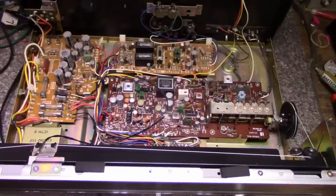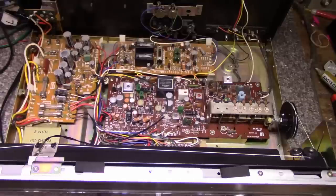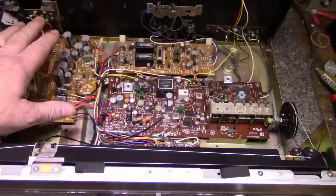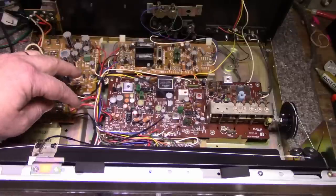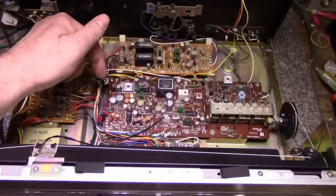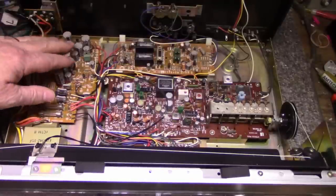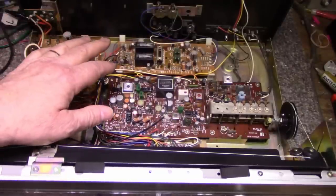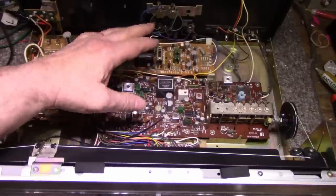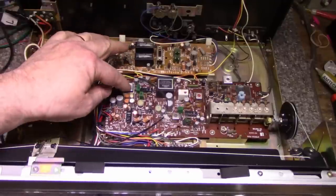They're good chips if they work; if they don't you replace them. We've got three fuses for a tuner — interesting — I don't know why we need so much power for a tuner that was only drawing 8 watts. I want to make sure the power supply is working properly, figure out that switch — it's probably dirty, needs a good clean. That still doesn't explain why we have no stereo separation, no demultiplexing. We'll check caps and replace any that need it, clean the switch, then focus on why we don't have FM stereo.